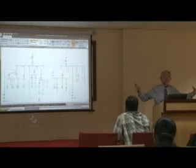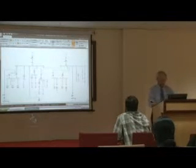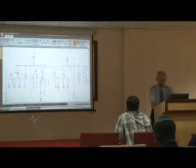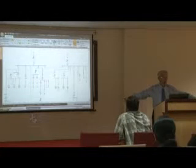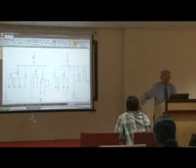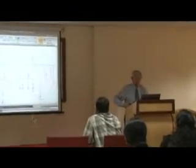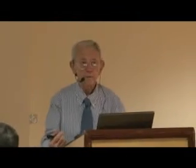I was calculating one time, because somebody said this is dangerous, and I thought, it's not that dangerous, I haven't worked yet. But I thought if I stand this far away, which is 40, 50 centimeters from the panel, and there's this sudden arc of, I figured 1,000 ampere, it's an easy number to work with. But the force on my body, and I thought, well, I'm not that big, so it's a small area, was several hundred pounds. And I thought if I were playing football and somebody weighing several hundred pounds hit me, and that was with a small arc, so there's the pressure from that. There's the energy from the heat, because the heat of an arc, you're thinking of the surface of the sun or more, it's a tremendous amount of energy.